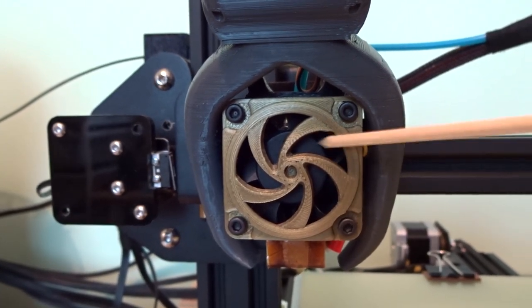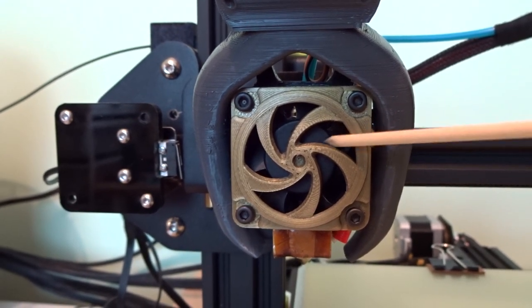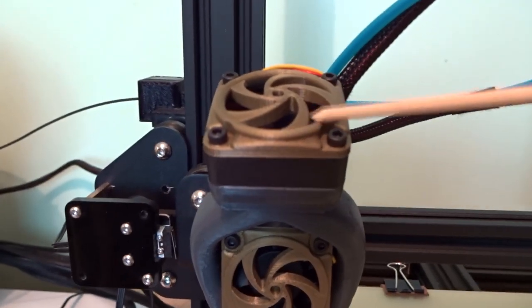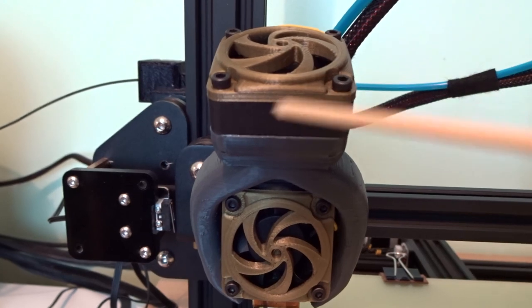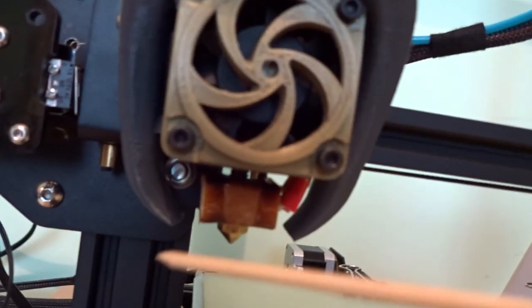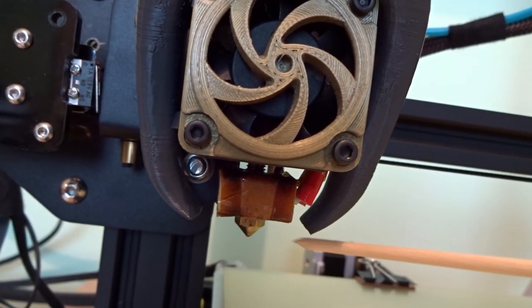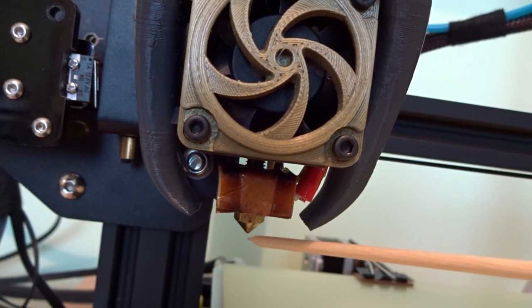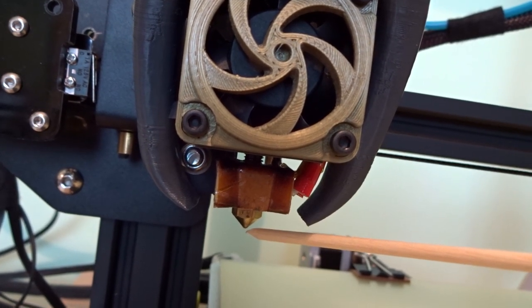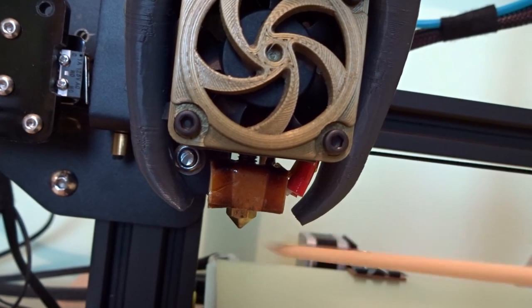This is the cooling fan — a custom one I printed. This fan is the hot-end cooling fan; it keeps the filament cool up top while the bottom stays hot. Then this one here is the part cooling fan — it takes air in, pushes it around these fan ducts, and at the bottom it comes out either side to provide even cooling at just the right angle. As the filament leaves the nozzle it hits the part and cools as fast as possible to make it solid.